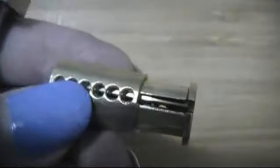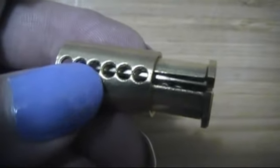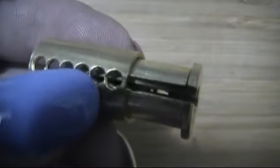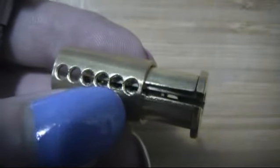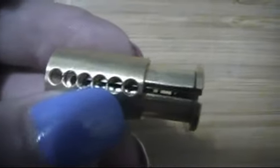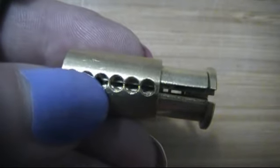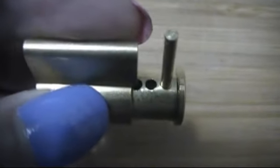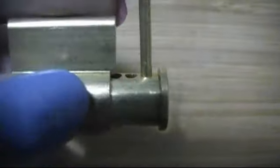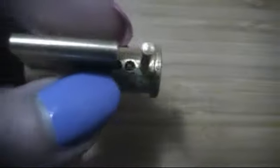In theory, you could paint over it, you could use a tiny screw. There's a million and one ways to make it more permanent and not have to worry about that, and feel free to use any of those, but I'm going to do it this way so I can take the whole thing apart again if I want to. It needs to be lined up with the space between two of these holes. So I'm going to line it up between those two, and just drill it somewhere down here, a little bit lower than 90 degrees, so that I got more material to work with.